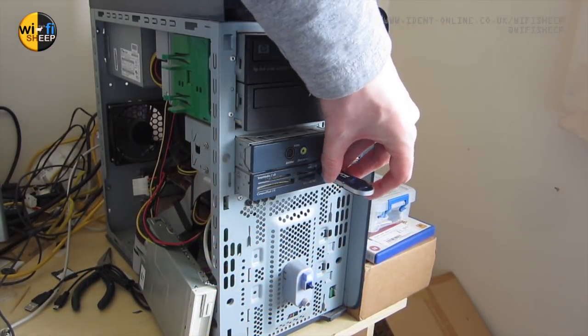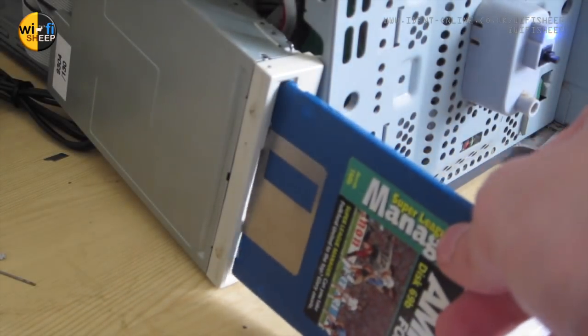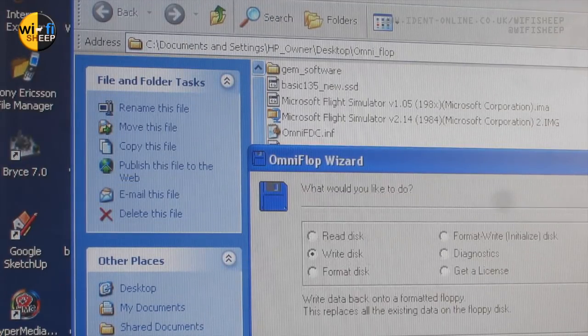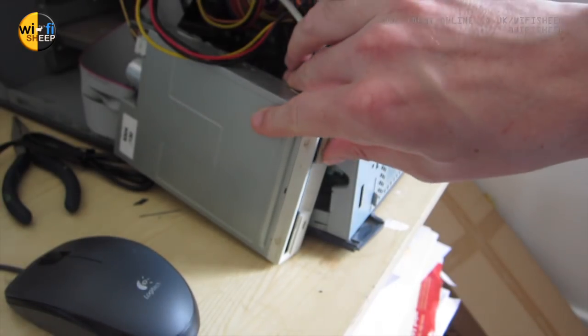Moving over to my Bridge PC, we've got some files needed loaded from the internet, loaded onto USB stick, and I'm going to write these to a compatible floppy disk. To do that, I'll put a used blank double density disk in the drive, and on Windows, using a program called OmniFlop, I'm going to format and write BBC Micro disk images to a compatible floppy disk. This is actually now writing BBC Micro DFS format floppy disks. With that done, we'll eject the disk.